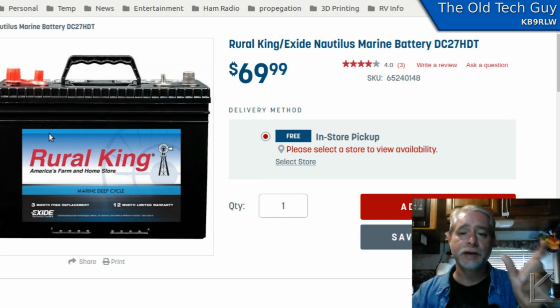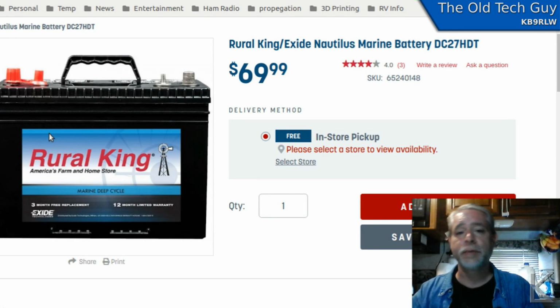I don't use the inverter for that. I have a direct 12 volt to 19 volt converter. So I'm doing one step of conversion to bring power up for the laptop, and that's 42% more efficient than running the inverter and using the laptop's adapter. I showed that in an earlier video, so that's a big improvement there. The amateur radio gear all runs off 12 volts. I've adapted my audio amplifier for my speakers. It runs directly off 12 volts. I've adapted most things to run directly off the 12 volts for efficiency. So my power requirements are nowhere near what most people are.